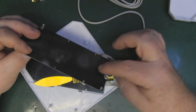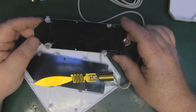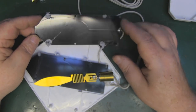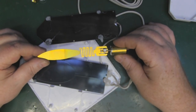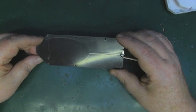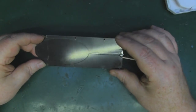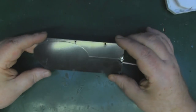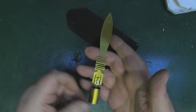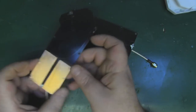It's nowhere near the claimed gain on the box — really basic antenna design with a very high VSWR. When you compare it to the more sophisticated Cisco design using the same general method, you can just see the difference between the two. You can learn so much from taking apart other antennas — this Cisco antenna has so much RF design going on; it's not as simple as it looks.